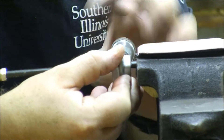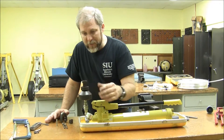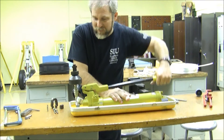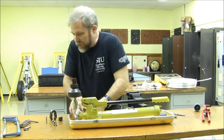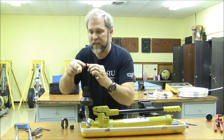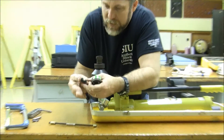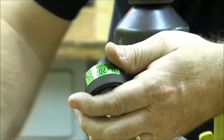We'll use a tubing cutter to cut the damaged part out. What I have here is a Deutsch swaging machine, and we're going to swage a splice onto this tube that we just damaged and cut. This particular machine has a hydraulic power pack capable of about 5,500 psi, and that's where the power to actually do the swaging will come from. The swage itself is a little steel tube that's been treated, and it slips right over both ends so that we can splice in that piece — we can use two to splice in a missing piece. The magic actually happens with this little set of dies right here; these dies are going to compress down over that tube and squeeze them down permanently over the top.